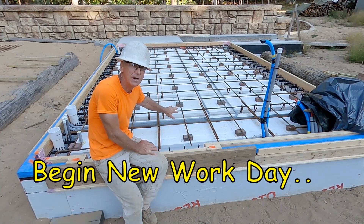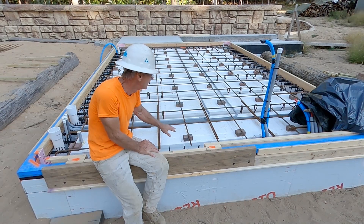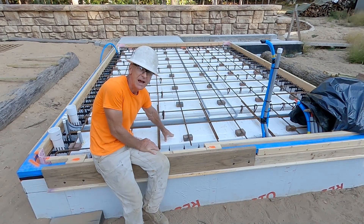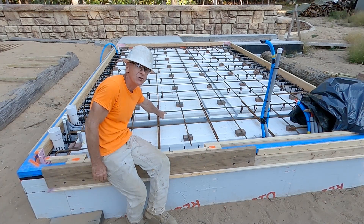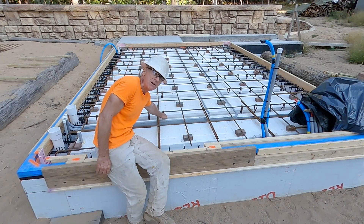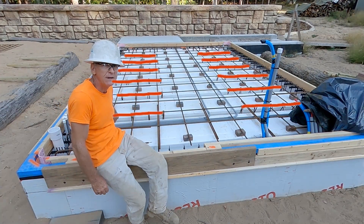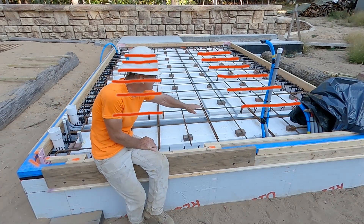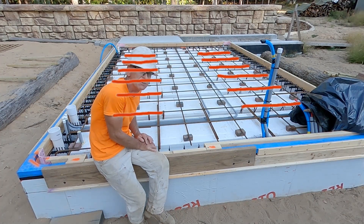What you see right here is all that's needed to create a roof over my root cellar. I have my build deck ICFs, my 12-inch by 12-inch number four rebar half-inch rebar grid, and my S-shaped stirrups holding the heavy-duty rebar down in the I-beam channel, favoring four feet from each end. Notice right down the middle — no stirrups down the middle.